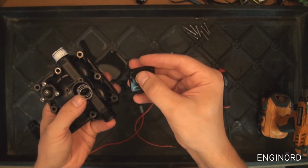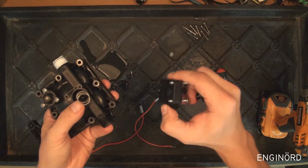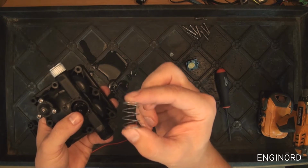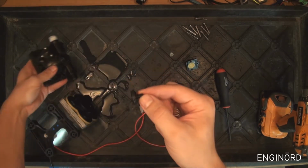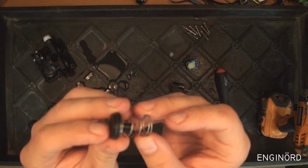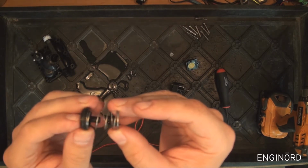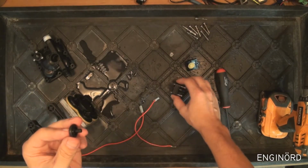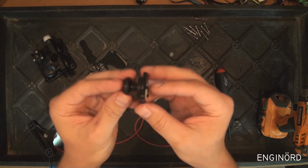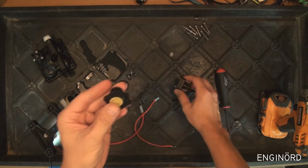So this is supposed to seal off the internal cavity where the water flows from this region where the actual switching action is occurring. So there's a spring here, and this spring is gonna preload this plunger. And when the pressure on this side rises, this plunger is gonna move to the right against the spring, compress the spring, and then the end of the plunger is gonna depress, it goes in there and it's gonna actuate the switch on and off.